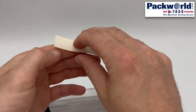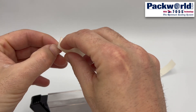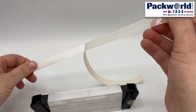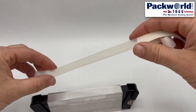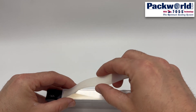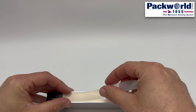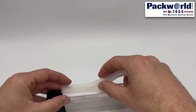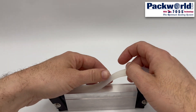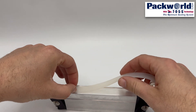The insulation layer can now be reapplied. Remove the liner on the insulation layer to expose the adhesive backing. Materials like silicone can sometimes shrink a marginal amount when peeling off the liner, so utilizing strips or rolls with material longer than your jaw bar can help avoid coming up short. A very important part of rebuilding the jaw bar is installing the insulation layer correctly — our jaw bars incorporate a groove which helps retain the shape of the silicone, and the silicone should be placed within the groove using your fingers to guide it.